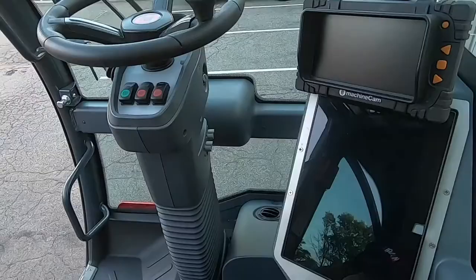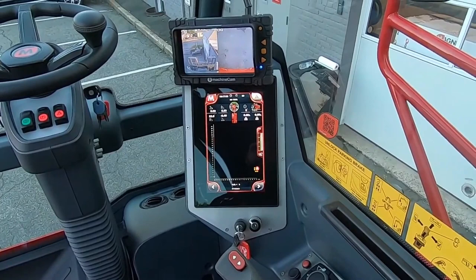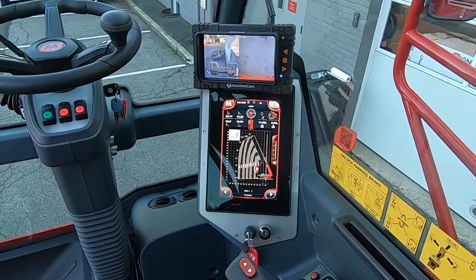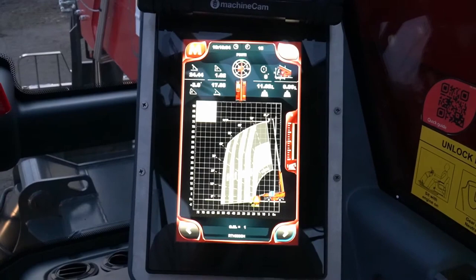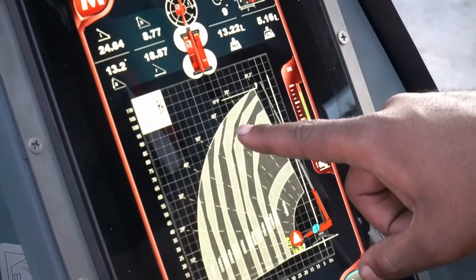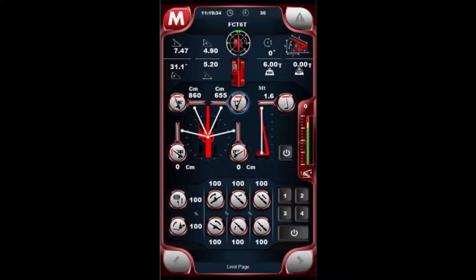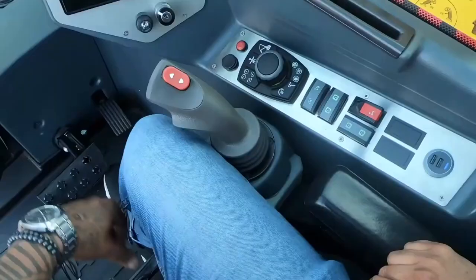To start the machine, insert the key into the ignition switch and turn it clockwise one click only — this will not start the machine, but will allow it to fully load all the software and systems. To validate that the machine is ready to start, view the rollover indicator bar graph which will be at zero when ready. To start the engine, the transmission must be in neutral; turn the key clockwise an additional click and hold until the engine starts. The user-friendly touchscreen is used to manage the whole machine — it is highly intuitive, can present in 12 different languages, and gathers all usage data displayed over five different pages. The Magni has integrated diagnostics for fast and simple troubleshooting of electrical issues. If a fault is detected, the system automatically shuts off any movement likely to worsen the fault and displays an alarm code to share with your dealer's service department.